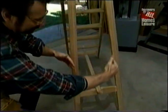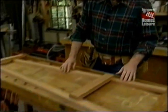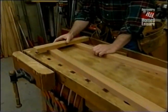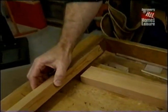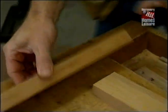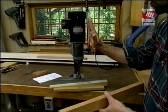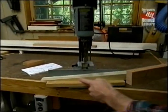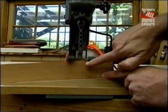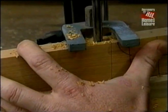There are a couple legs, and if you look closer, you can see that they splay out. That angle is about five degrees. Here are the pieces laid out on the bench. Because of the splay, the bottom of the leg and the top of the leg are cut at five degrees. I'm going to connect the pieces together with mortise and tenon joints. I've laid out the location on the mortises for this top rail. Now, the mortise also has to be made at five degrees. I'm unable to tip my designated mortiser to five degrees, but if I make a wedge that's cut at five degrees, it sets it up so that when the mortising chisel passes in, it follows exactly on the layout line. I'm using a three-eighths inch chisel, and I've set it up for a depth of about an inch and a half.